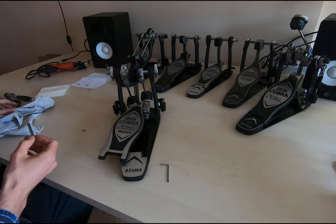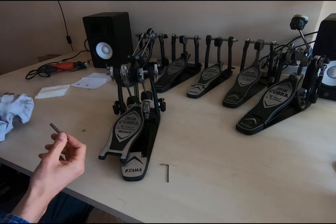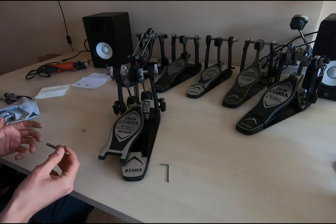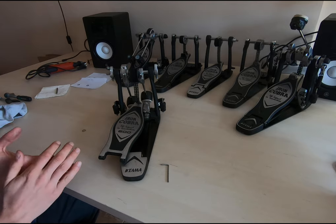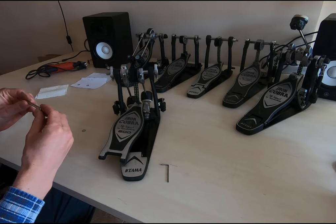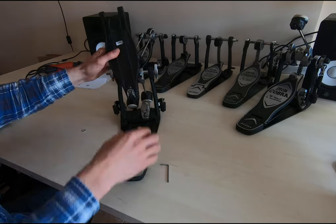I think the set screw marks are one problem, because after years of motion and play, maybe you can just fix it by tightening the set screws a little bit. But if not, you have to use a washer. After time, the set screws leave more marks in the metal rod, so they can no longer hold the metal rod as tightly as in the beginning.